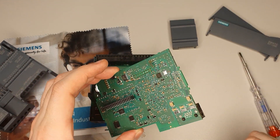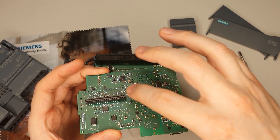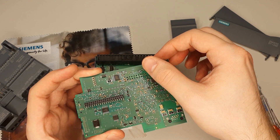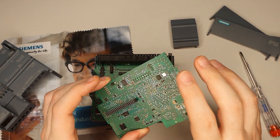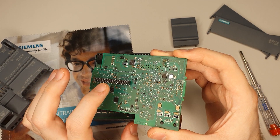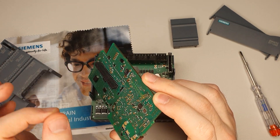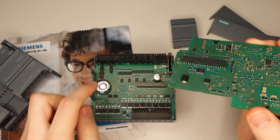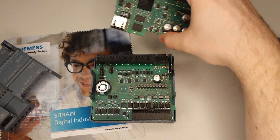What I can see here is the connection for I/Os, logic, and power. But those pins — I don't know if you can see it on video — are pretty bent, and there are even some connections missing. Those are definitely broken. This is already the problem. I don't have spare parts for this; I need a module basically with five-by-five pin connections. I can desolder the broken block and solder a replacement, which would make the connection much easier.